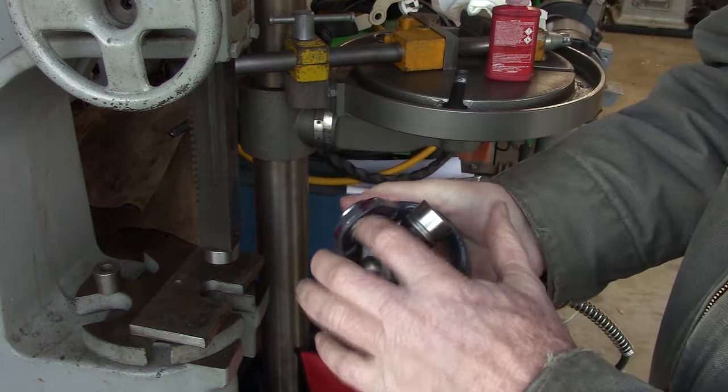Here's the way I do that: I put a piece of round stock in the vise and work my way around — tap, tap, tap, tap. It takes a fair amount of tapping to get it to expand. You'll never get it perfectly even all the way around, and these do spring back a little when you take it apart. Better to put a new one in, but if you're careful you can reuse them.